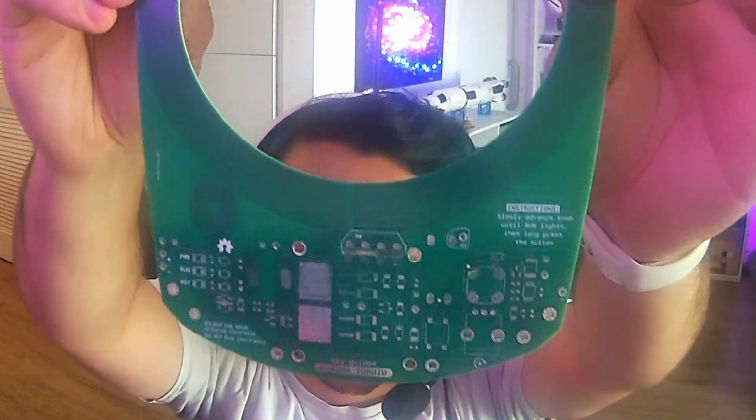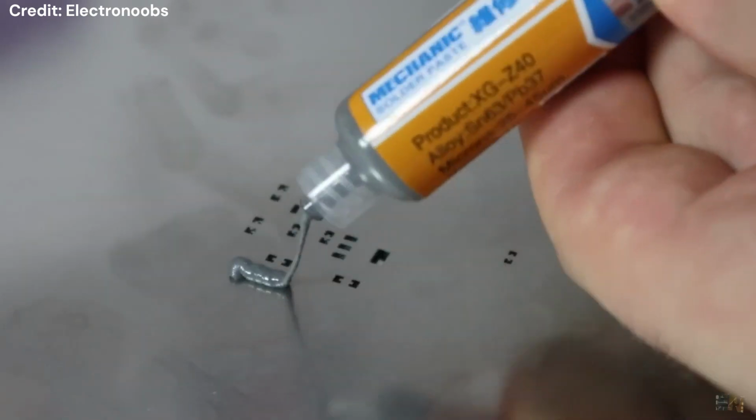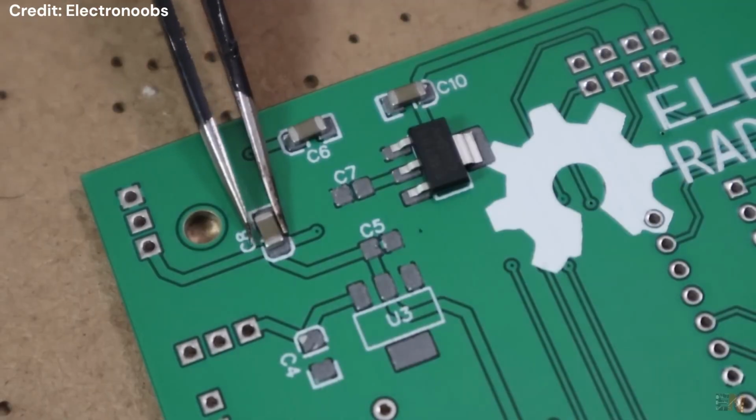Okay, so one of the goals for this project for myself is to, instead of using a soldering iron and a roll of solder, I instead want to use a stencil to cover all the pads I want to solder to. That involves using solder paste and a card and the stencil to apply it to the pads, and a hot air station. So I just recently got this and I want to try using it. And I'm not sure how successful I will be in doing that.